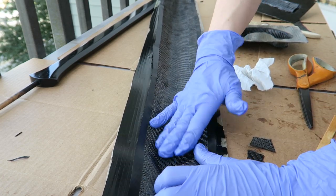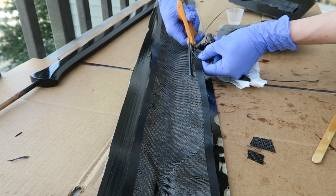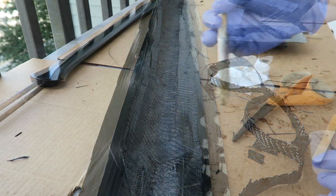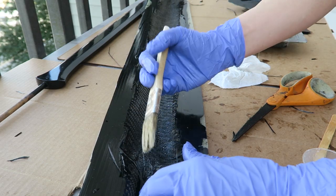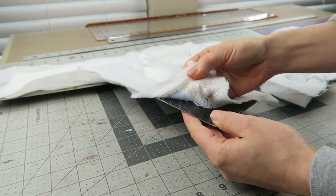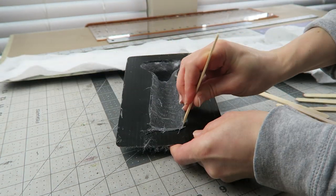This is a 2x2 twill weave, so it does form pretty well, but the smallest detail areas do have to be trimmed to get everything into place. Then I'm just going to wet everything out with the resin. I placed that into a vacuum bag to cure along with a release layer and the breather cloth so that any excess resin has a place to go.